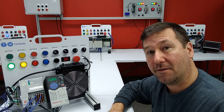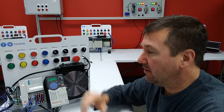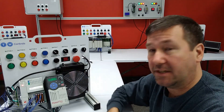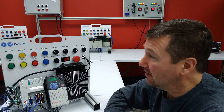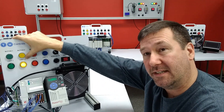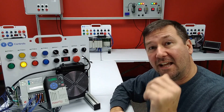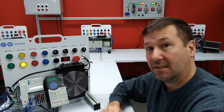So I'm going to cycle the power to my trainer. We're waiting for our trainer to come back on. One thing to note while we're waiting is until this run light is solid green, we are not running. We need to wait until we see that to make a determination of what's going to happen here. Just recall, both lights were on when we powered off the PLC and only the yellow light came back on. And that has to do with pre-scan conditions that happen to the output energized and don't happen to the output latch.